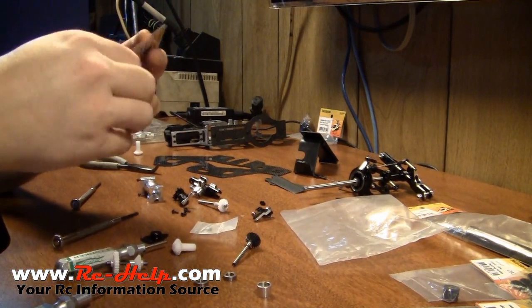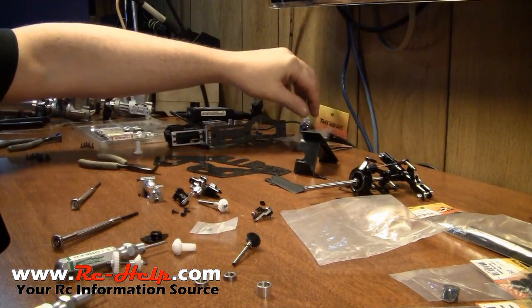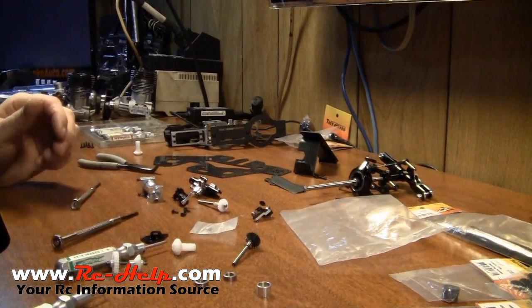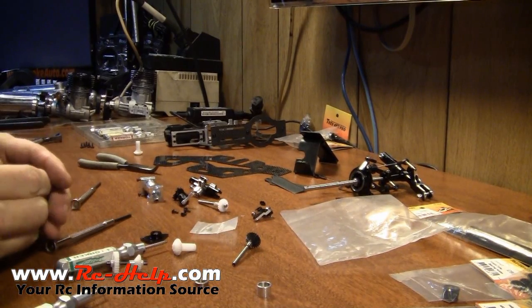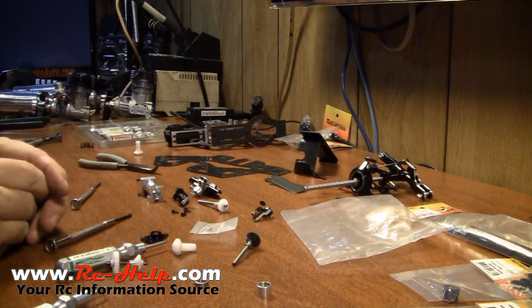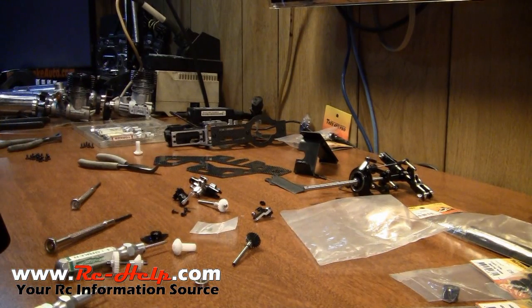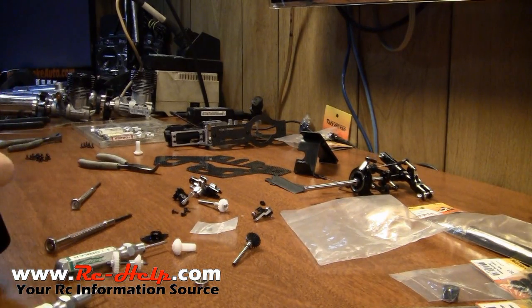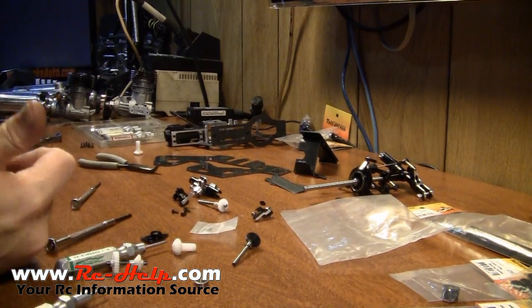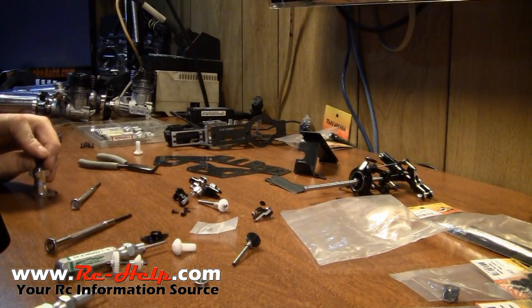One of the other gear, whatever it's called. We'll set those aside. Those are for if and when we crash. Slide the bearing onto here, and again, it's going to be really, really tight. Alright, so the way we're going to slide this on is we're going to take our sleeve, put it down in there, then we're going to take our gear, put it in there, and then just kind of press it in. So I'm going to press this in, and I'll be right back.